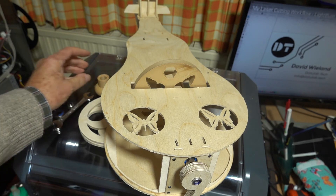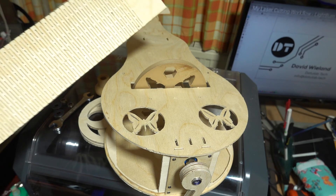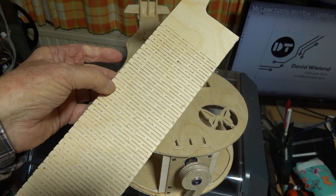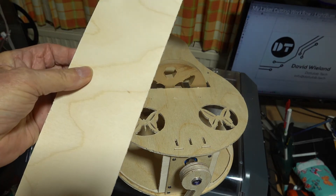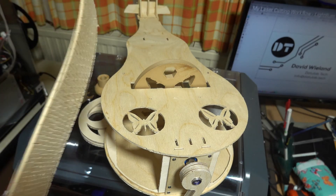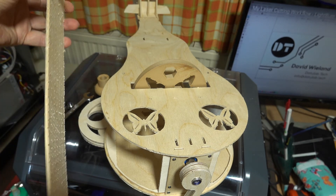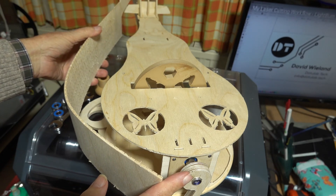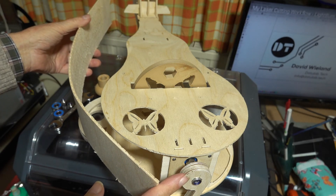The other thing I've done is I've started cutting the sides. I've only cut the slots halfway through the plywood — one and a half millimeters — so that the outside is nice pristine plywood. I'm quite pleased with the result because there's plenty of bend in it and I should be able to wrap that around the sides without any difficulty. I'm just going to mill the other side and then I will attach the sides.